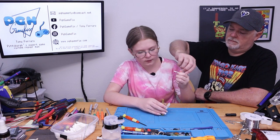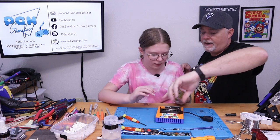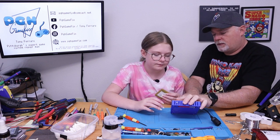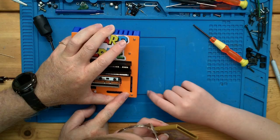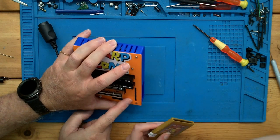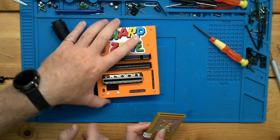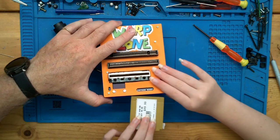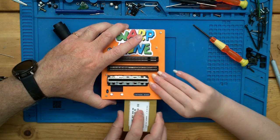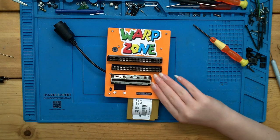All right. Okay, get our little machine. There's the machine. Now this is a Game Boy Color game, not a Game Boy Advance game, so we need to make sure it's 5 volts. What's this first little one say? 3V and 5V. Which way is 5 volts, up or down? Up. Okay, so we switched it to up. Flip the cartridge over and stick it in the port. Perfect. It's probably hanging down and hitting the board inside. We can't help that. Go ahead and turn it on.